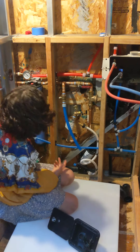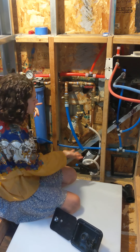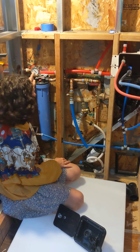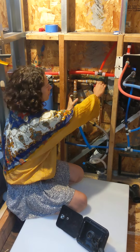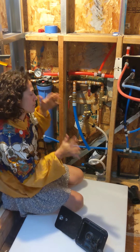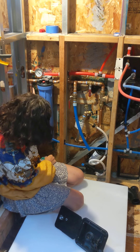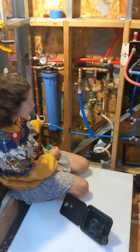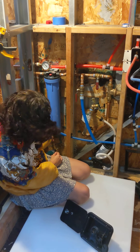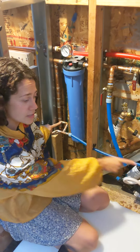Both lines meet up and go to my descaler. I've also got a pressure valve so that whichever system I'm using — tank or city water — I can check the water pressure and turn it off if I'm not using it or if the pressure is too high. After that, the cold water travels down through this copper arm that took me forever to solder.